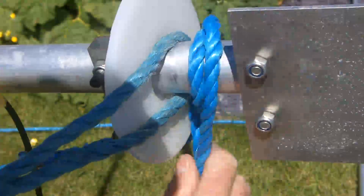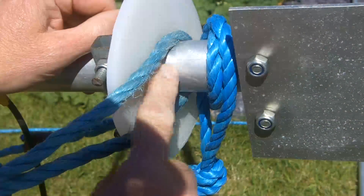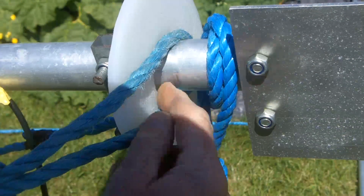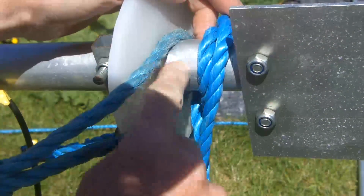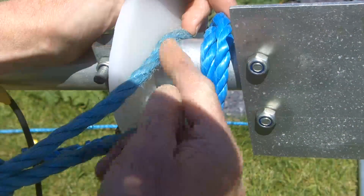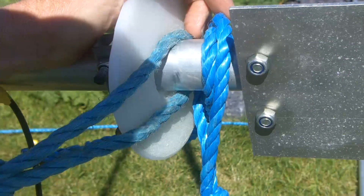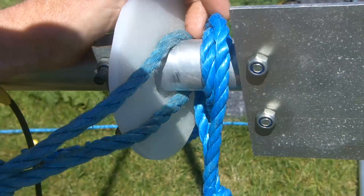These are my three guy ropes at the top of the mast. I'm putting a rotator on it, so I'll put a plastic or nylon tube around here so that the ropes go onto a stationary tube. Any friction will be between that nylon tube and the mast, rather than the mast wearing away and possibly cutting into the ropes. Aluminium oxide is extremely abrasive — you use it to polish glass.